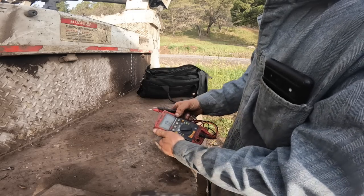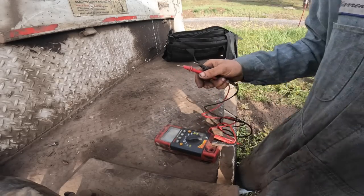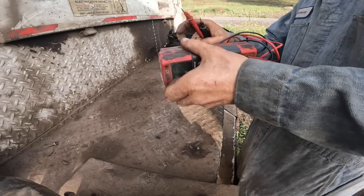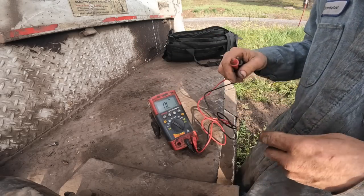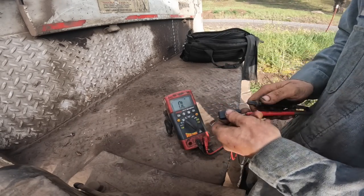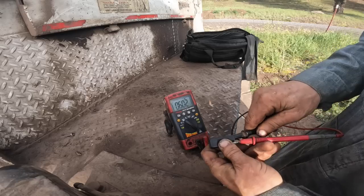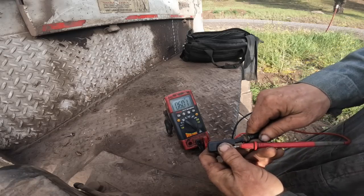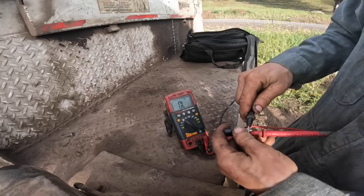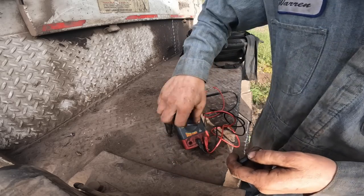Okay, go to your ohm meter, function, bam, diode check. I don't know if the camera is picking up what the meter's reading. Is that picking up what the meter's reading? Not really, huh? Let's flop this up. Here's the new diode. The old diode, I had continuity in both directions. This diode, I do not. Well, I didn't. So get your leads and go that way. 0.601. Swap them. Go into the other port with the red lead. See, now we have no continuity. This diode is good. The other one was bad.